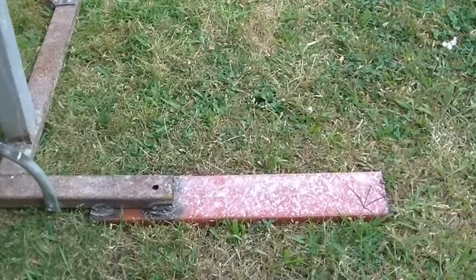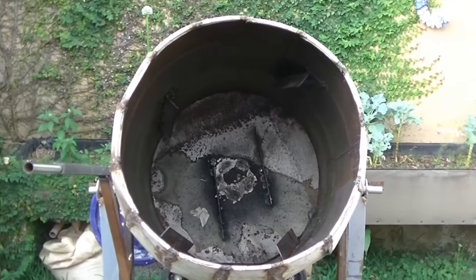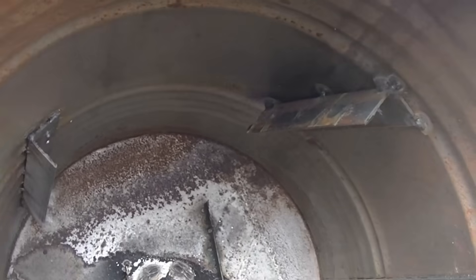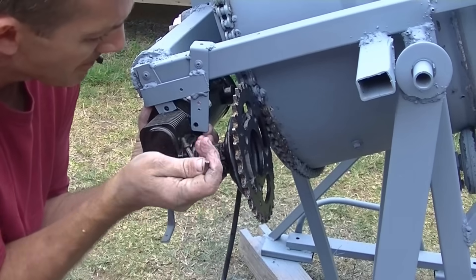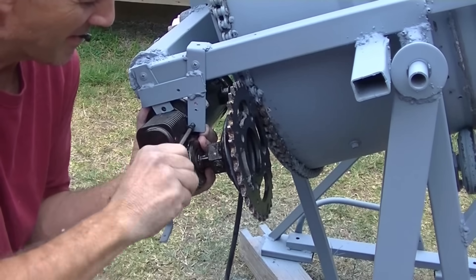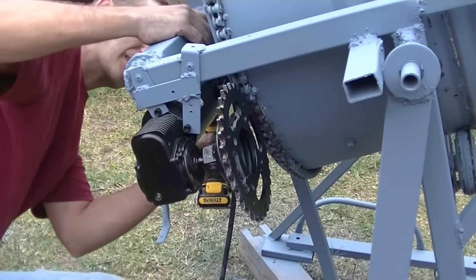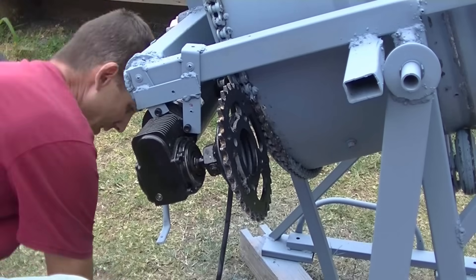Here are the new legs I added — you can see it's a little rusty now. I started this about two months ago and just did a little concrete work mixing by hand again, so I'm back on it. I put some angle iron inside, welded and bolted it, and that's for the mixing action inside. The hardest part of this build was figuring out how to take a motor and get it to rotate with enough torque and power, and slow enough to turn the barrel at the right speed. I got really lucky at a salvage yard and found a 90 volt DC gear driven motor. The guy gave it to me since I buy stuff from him all the time. I welded a motorcycle sprocket to the front gear drive and that fits the chain that goes around the barrel.